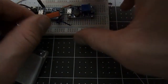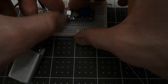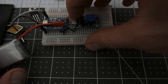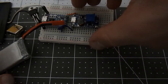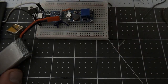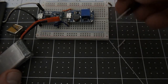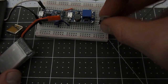And then put it like here. Okay. So I attach the leads from the output of this to the input of the voltage booster. And the next part is, so that's part 2. I guess part 3 would be to regulate that voltage. So you would need a voltage regulator to 5 volts. And I'm going to put that right about here.